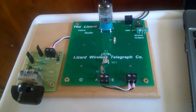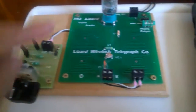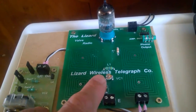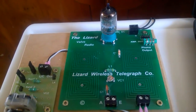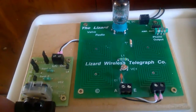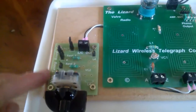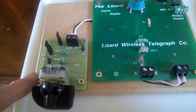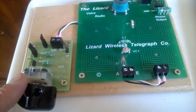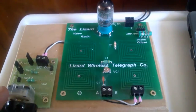You can buy this in various forms. You can buy it without this hand board and just buy the main unit, and you would actually tune it just with this small micro variable capacitor, but that would only give you a limited range. If you want to extend the system further, you can buy this board as well as part of the kit, which will extend the frequency range quite a lot. I highly recommend buying it with this board so you can have a little bit more selection of bands when tuning this small radio.